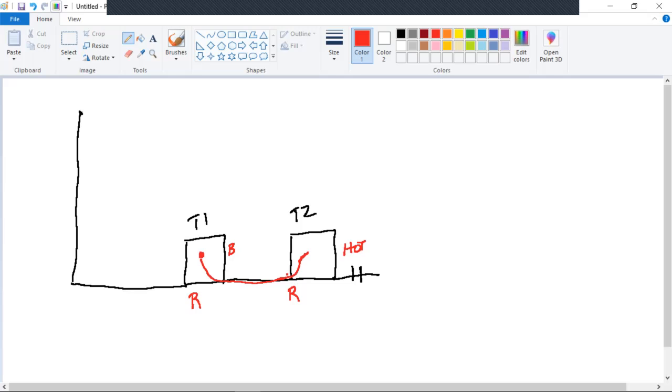Just step back one, park this wire. Now every cable in the transformer is de-energized. That one's dead-ended, de-energized. This one's de-energized going back from this direction. So that is a good general practice. Anytime that you run into a situation where you can take conductor and not lose customers to be able to de-energize cable, go ahead and take advantage of it. Right. Okay.